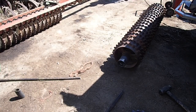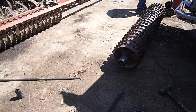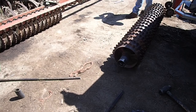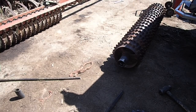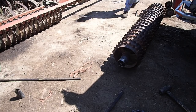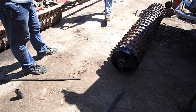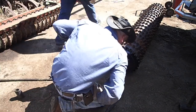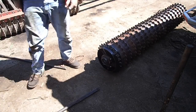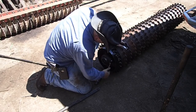So I'm expecting the correct one to come in — it is about eight to ten inches longer — and it's going to be somewhere around $400, maybe a little bit more. But anyways, I did get that thing shrunk down on there. When you put that kind of heat to a pipe and then you tap it on, I actually forge welded a little bit on the ends. There were some cracks and when I tapped it over, it overlapped and I smacked it on and it looked like it went right back together.